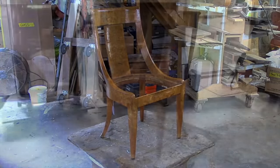And in theory, all this wood in here doesn't show, but I'm going to just put some stain on it anyway, just in case. I don't want the raw wood to show around the knuckles. Okay, I've let that dye stain dry for a couple hours. Now I'm going to try some oil stain. I'll go over the whole thing. I have some raw umber oil stain, and I'm using that because it doesn't have any red in it.